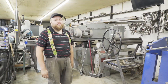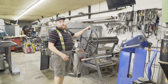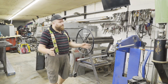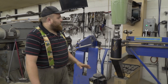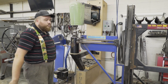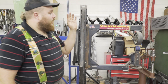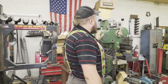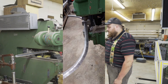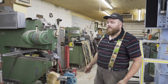These are a bunch of my sheet metal machines. The Pullmax I keep with dedicated shrinking dies on it — good for sheet metal forming and shaping work. This is a roller I built that can roll up to quarter-inch aluminum, great for when you cut wheels in half and widen them. This is a bead roller. This is a power hammer — good for stretching, and it also works great with toenail dies which will shrink metal; you can make some nice shapes with those. I have an English wheel with a bead roller, and a rubber wheel for forming long curves. This is my more general-purpose Pullmax with dies for forming wheel lips and all sorts of specialty sheet metal work.